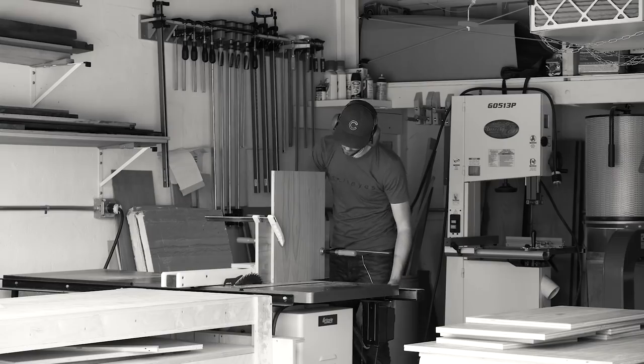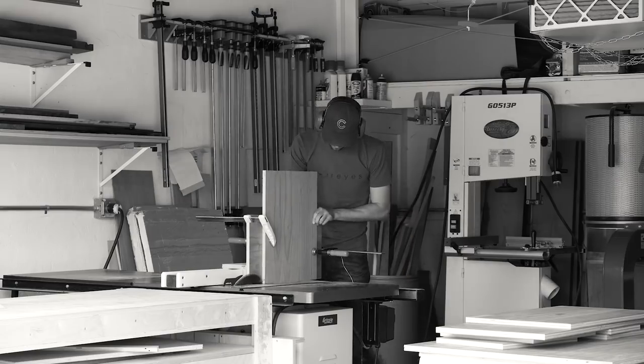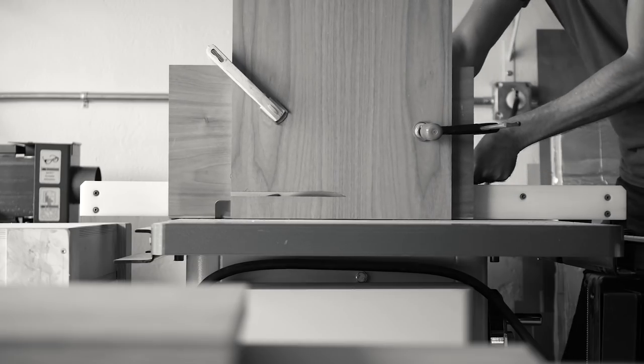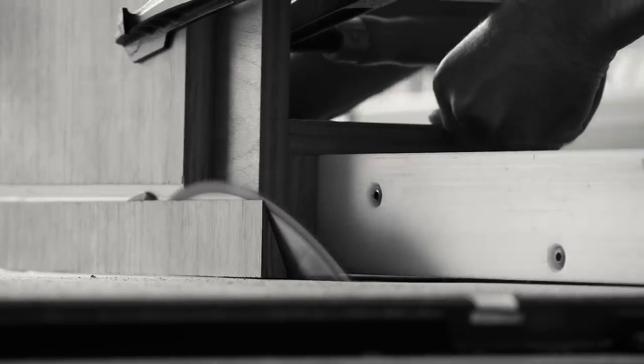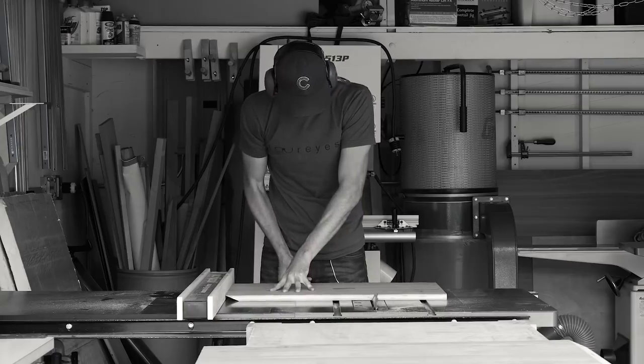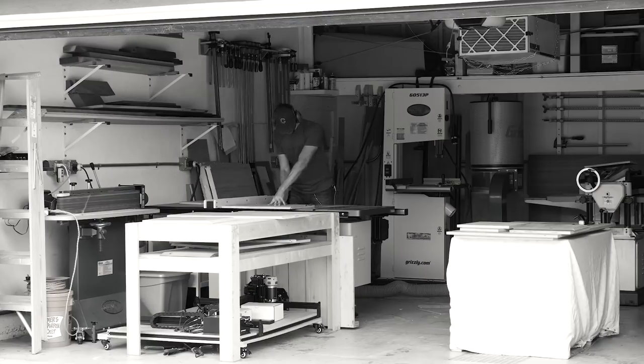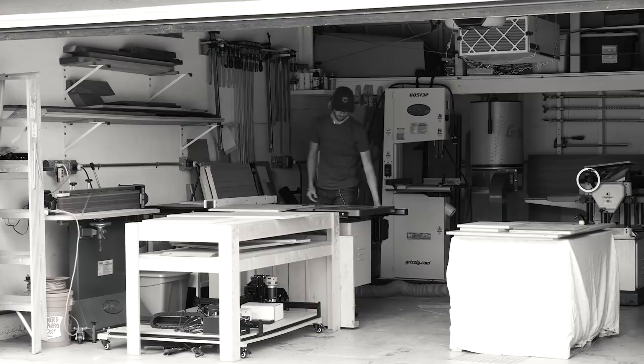Back to real life — here I'm setting my blade to 67.5 degrees, or if you went according to the dial on my table saw, 22.5 degrees, and then locking it in place. I started by making all the cuts with the workpiece vertical, then moved on to making the others with the workpiece horizontal. After all those had been cut, I could cut the remaining angles that are a more standard 45-degree bevel to make up the right-angled miters, which are also the cuts that finalize the length of each piece.